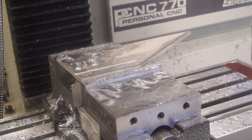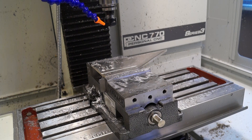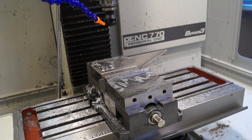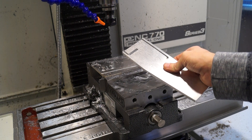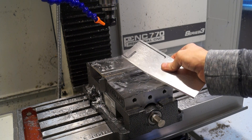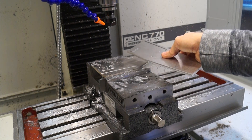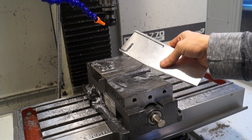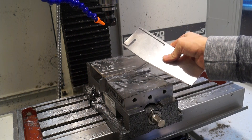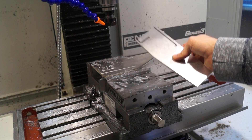Fine, so I'm stuck until I order more 1/8-inch end mills. Actually, I refuse to be stuck. I've got this one that's mostly done. I'm going to use a bigger end mill, rip the vice out, put the part underneath and clamp it down, and just get this outline done. I don't care if it's pretty — I just want this project done.